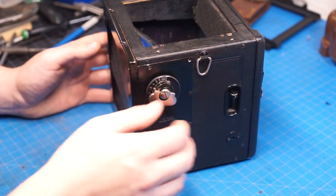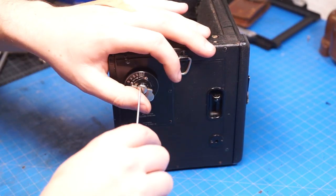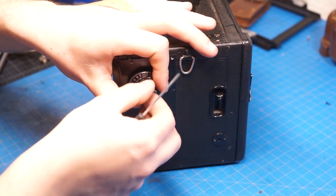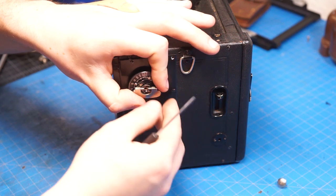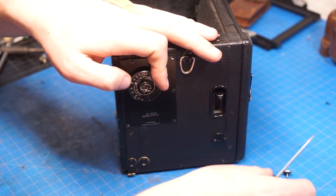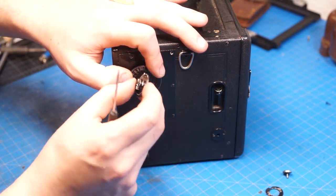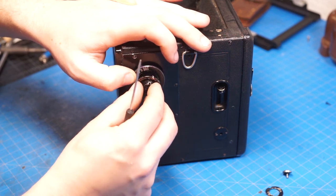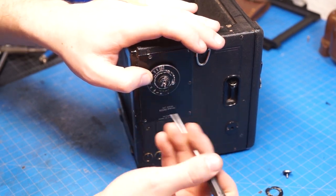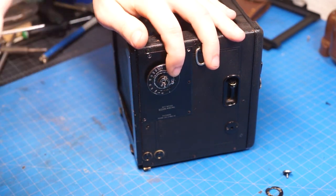What's actually happening in here is this main outer gear is setting the whole timing of the thing. We can demonstrate that by pulling off this main screw — we can pull this whole thing off. As long as you understand that one of these is supposed to be facing up, we pull this out, pull off the key, and we see this is a square shaft right here. This little spring detent holds that knob up, and there's a secondary part bored out square that holds onto the shaft. All these detents actually correspond to gear teeth and the whole ratio of things for lifting these two apertures differently from each other.